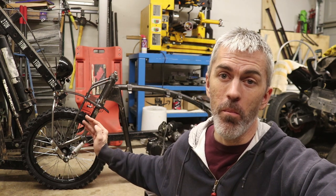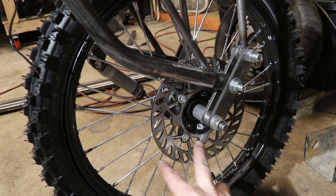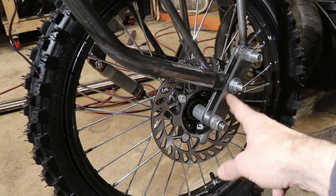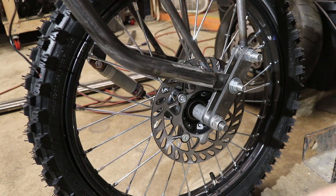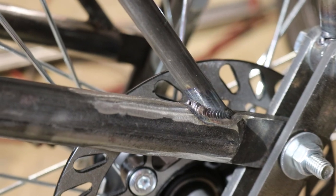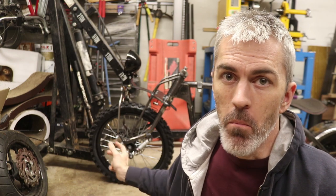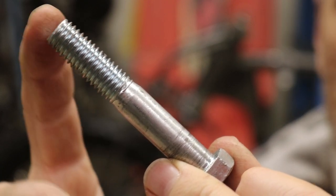The other thing I need to play with is the front brake — I'm going to do that in a whole separate video. You can see our brake rotor here. The problem is that we need to mount a caliper somewhere, and there's some physics involved that is a bit complicated. I'm basically going to end up having to cut out a new link piece and off of that mount the caliper hanging out back here. There may be some other engineering solutions to reduce brake dive on this, because that is my major hurdle having to mount it back here. I also need to go through and sort out all the bolts on this — I've still got just sort of mock-up bolts at the moment. I need to get them so they all have a nice shank going all the way through the components and then sort out the length of the thread on the end.